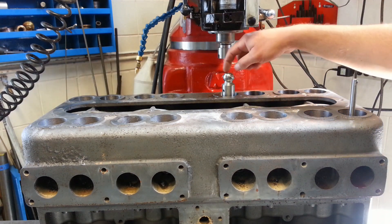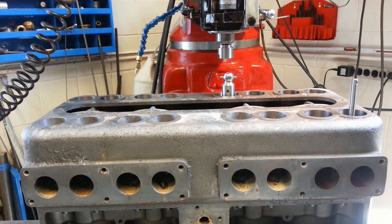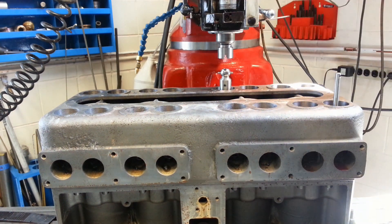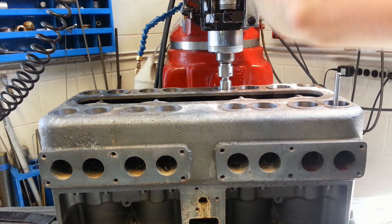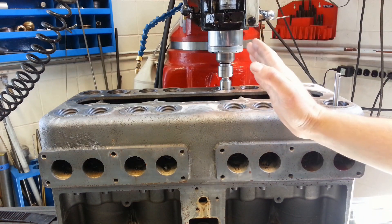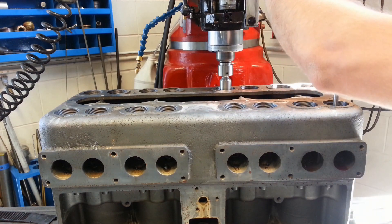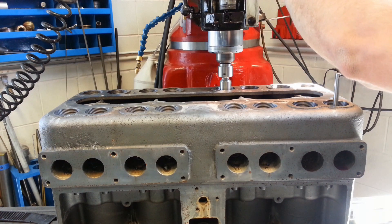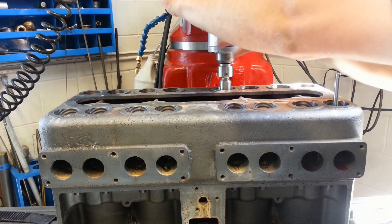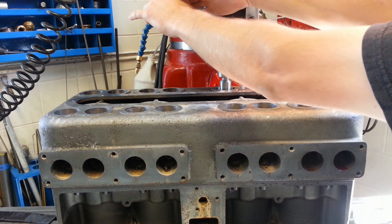Okay, I leveled it. I came in here and made sure that I'm on center to it with my indicator. Now it's time to cut it. I already put my lube on the seat to cut, and it's going to be a pretty big cut because this is a fresh casting and the pilot's probably way off from where it should be in terms of the center of the seat. To keep maximum rigidity and surface finish, I engage my auto feed — you can hear it's cutting on one side now — and I mark my zero to see how far we're going to be cutting.